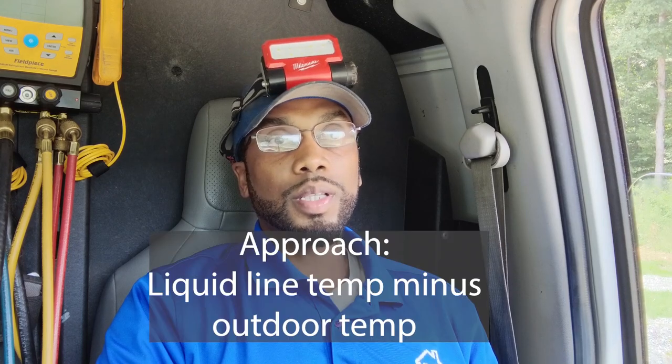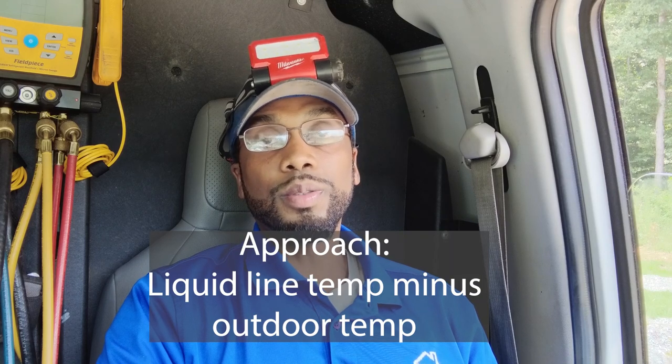So you want to use your outdoor air temperature to check your approach. And like I said, once again, MeasureQuick has a really cool non-invasive feature where they use all those temperatures and a formula to come up with the pressures it should be, coil temperatures, saturation temperature in the condenser, and evaporator temperature, and it comes up with your superheat. So you can pretty much use your non-invasive temperatures to guesstimate your superheat and subcooling. So I recommend doing that,